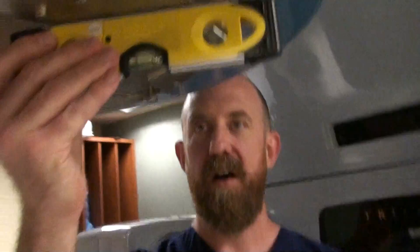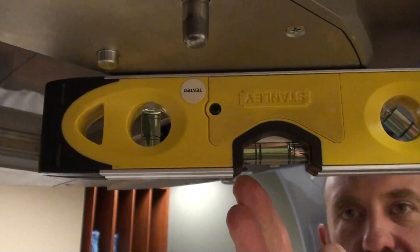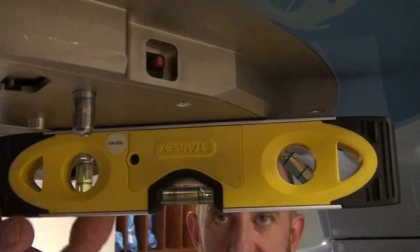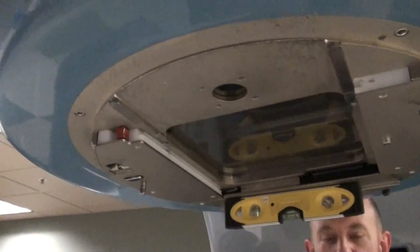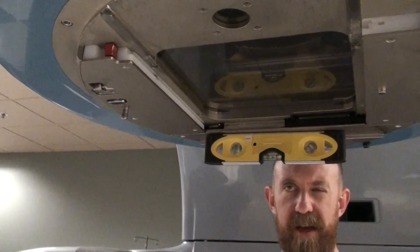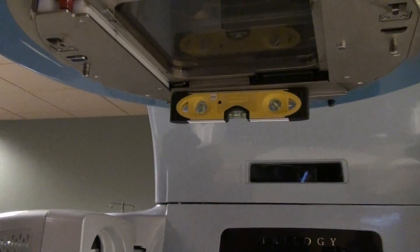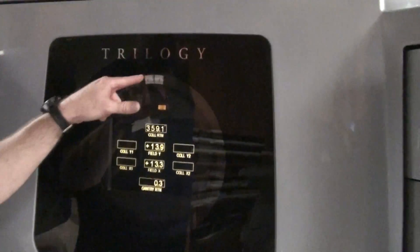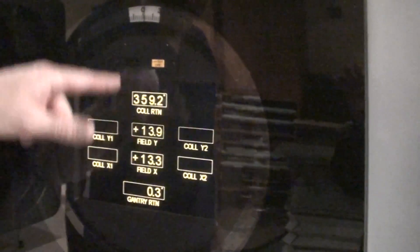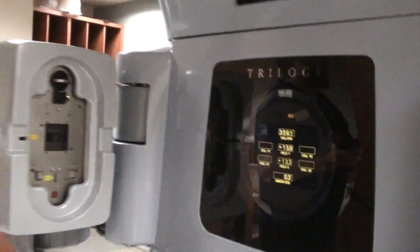There are two sets of lines and a bubble on the level. If you're standing to the side, you'll see three or four sets of lines. You need to have your face straight on with it so that the lines look relatively flat. I'm going to put it in place and move the gantry until it is level — get that bubble dead in the middle of the lines. Now I know the gantry is level in space. Looking at the digital and mechanical readout, we're off by 0.3. That's within tolerance. I don't like it, but it's within tolerance.